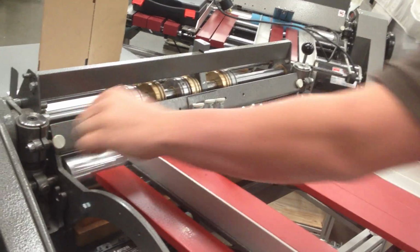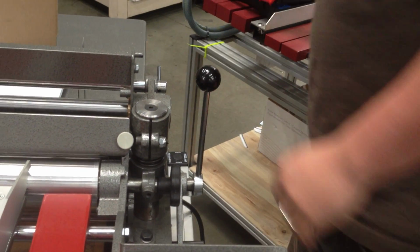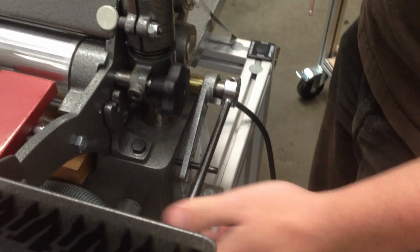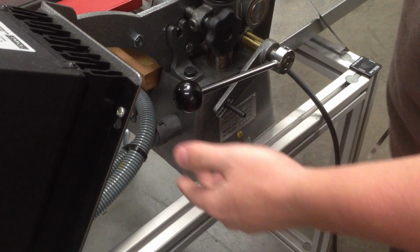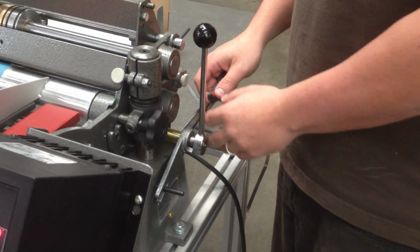What you have here is the pressure controller is locked in the up position. To unlock it, you need the Rollem hex wrench in the back of the unit. You slowly lower it. Start about 2 fingers and slowly lower it as you put the pressure through. When you're finished with the machine or you walk away and take a break, always put it in the vertical position and lock it.